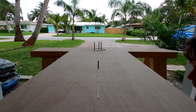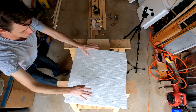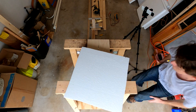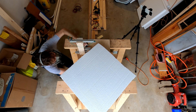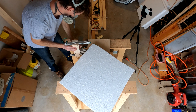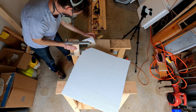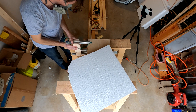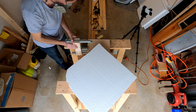Here I'm playing with the speed and direction controls. Depending on how big you cut, getting this exactly in the middle isn't necessary — it just has to be close. And with that, finally, we can start cutting. We are melting plastic and we are making fumes. That's why I'm doing this close to an open garage door. I'm wearing a 3M respirator with cartridges approved for organic vapor, and I've got a box fan running to clear out the fumes even faster. You should do the same.